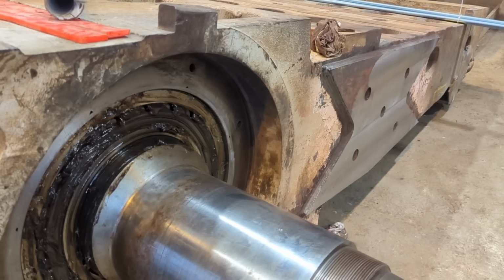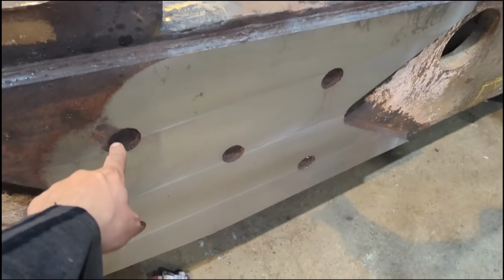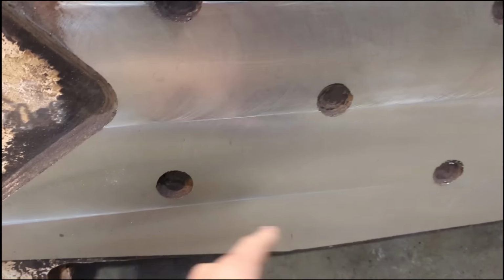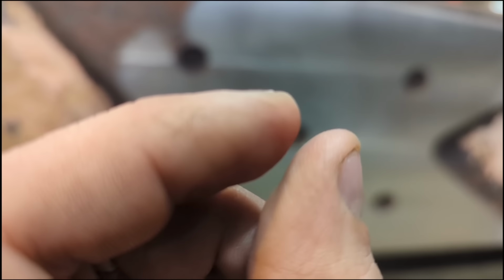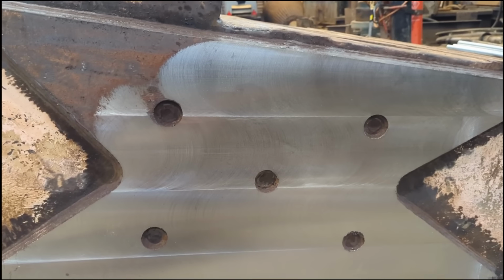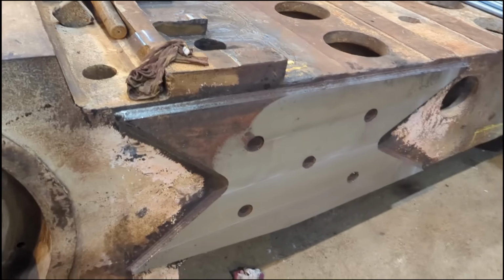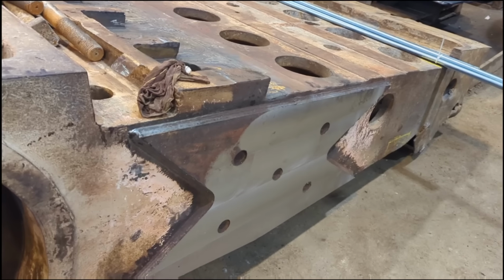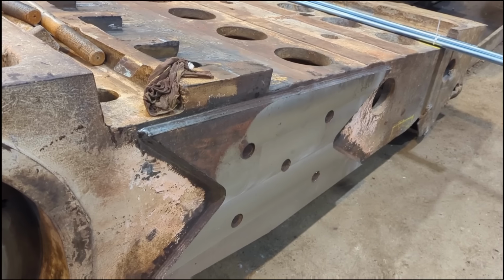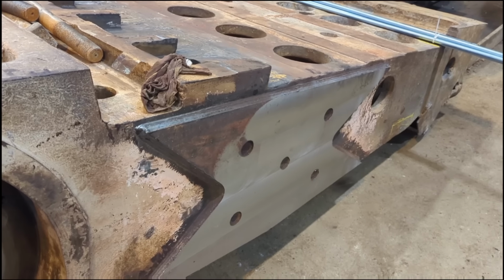So yeah, the entire perimeter is welded, and then a few of these plug welds, and behind every little area, you have half a mil of an air gap, because that casting is not perfectly flat, so whenever you set something flat on, it's going to have little pockets of air. I never in my wildest dreams expected those little pockets of air with an extremely low volume to expand enough to belly, to balloon those side plates out, and they did. So the learning curve there is leave a little hole for the air to escape.